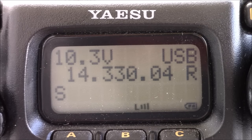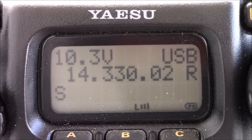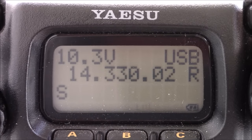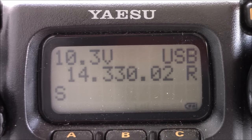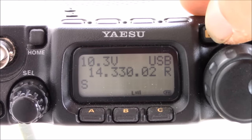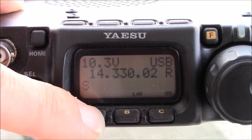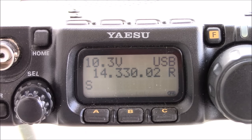I'm going to answer some questions I had to research. That icon blinking on the display — when you use internal battery power, the radio defaults to 2.5 watts. You hit the function button and change the select knob to 'power,' then hit the A button. Solid display is 2.5 watts, then 1 watt, then a tenth of a watt, and 5 watts blinking. I figured it defaulted to 5 watts, but it doesn't — that's something I had to learn.